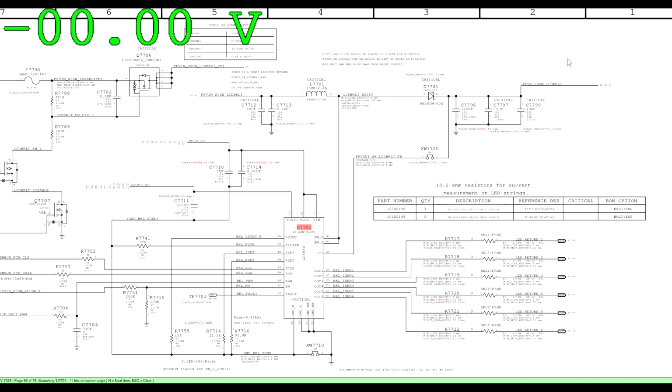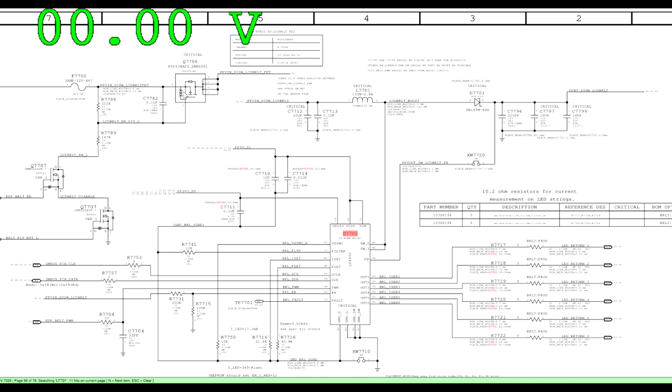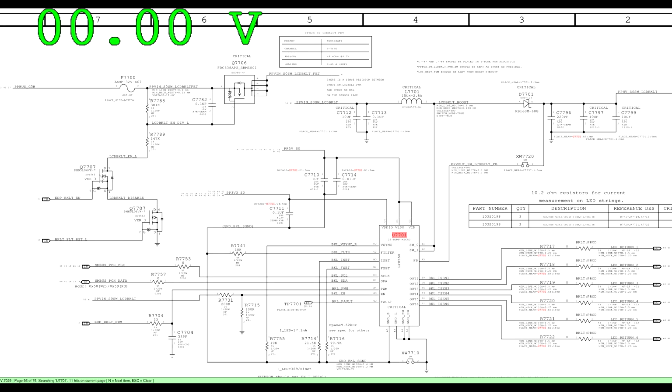So if I have 8 volts at output, I don't need to see if the coil is good. I don't need to see if this transistor is opening or if these two transistors are doing what they're supposed to or if these two signals are here or if this fuse is working, because I've answered multiple questions. And as you become more specialized in working on specific circuits, you should not just be looking to learn more, you should also become proficient with how you can save time in your troubleshooting by figuring out what you could measure that will give you the maximum amount of information in the least amount of time.